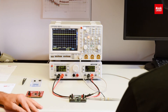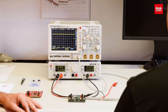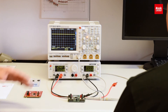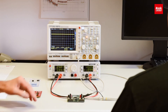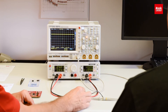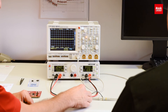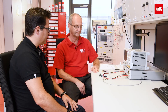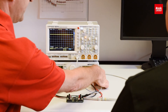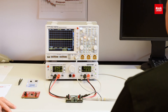As soon as I reach the current limit of the electronic load the output voltage goes to the maximum. If you don't want the output voltage to go to maximum, you can limit it with the voltage regulator — I limit it to 10 volts. If the short circuit is removed, you see the output voltage is limited to 10 volts. If I connect and reduce the current, the output voltage would drop to zero again. As soon as I remove it, it goes to the maximum that I set. Short circuit again — go to the current limit.